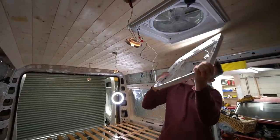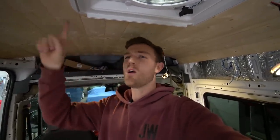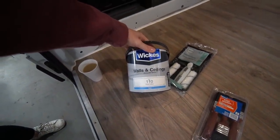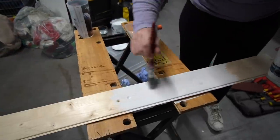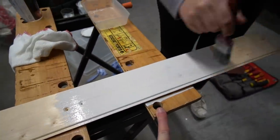Okay, everything is taken down. Now it's time to show you the process of how we're going to paint this ceiling. As per the recommendation of my younger sister, we are going to be giving this a whitewashed paint look. A lot of you like the sauna look - personally I don't. So a bit of white wash - we'll see how that looks. If it looks crap, I'll just paint everything white. I bought some rollers, a tray, some paint brushes, and some Wickes Finest Walls and Ceilings Smooth Finish Pure Cotton Matte. The technique is to paint it on, let it dry for about a minute, then get a rag and wipe it off - giving a whitewash look where you can still see the grain and the natural wood underneath but it still gives it a bit of colour.